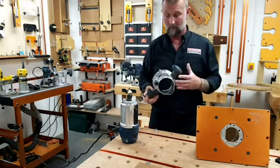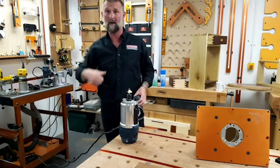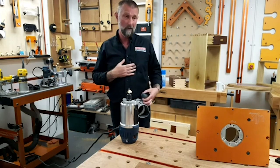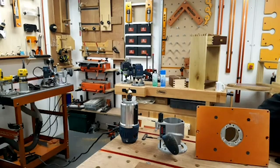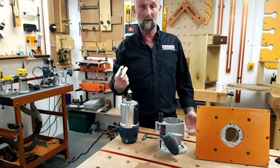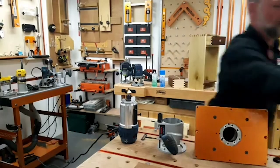That's a pretty cool setup. It's a powerful machine at 1600 watts. I know some routers go up to crazy power — 2200, 3000 watts sometimes — but I've never felt the need to go that powerful. Certainly with some of the big cutters we have to swing in the skill centre, like these panel-raising bits, it handles it; it doesn't stall, stutter, or slow down. Big favourite of mine — absolutely recommended.